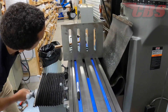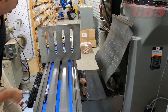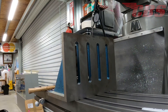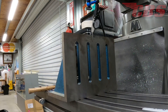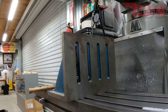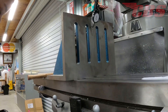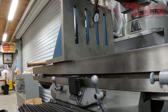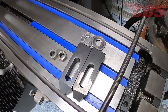The reason I decided to indicate the plate — honestly it's not strictly necessary for what I'm doing, but the crankcase has a shoulder and the only way to follow that shoulder is to simply indicate the plate. We're going to try to get it to zero as close as we possibly can. It's really important to check the travel up and down on the plate. If the plate has any taper or it's skewed, we need to correct that by shimming it. Since I had it Blanchard ground, the machine shop did a really nice job. I'm using the Z-axis to travel up and down to make sure it's at zero. The reason I didn't use the quill is that sometimes there is rock or movement in the quill that will throw your dimension off. I'm very happy with that dimension.